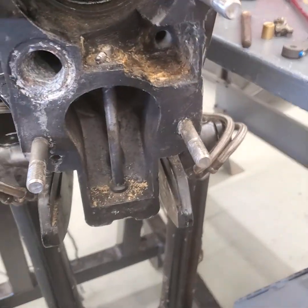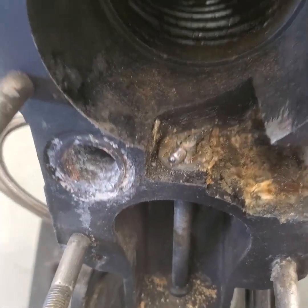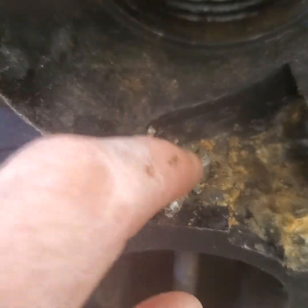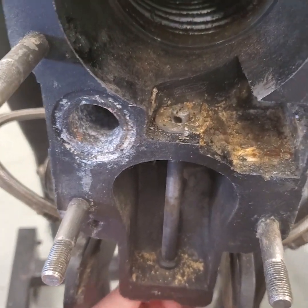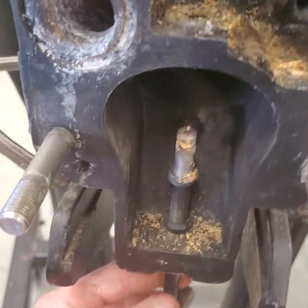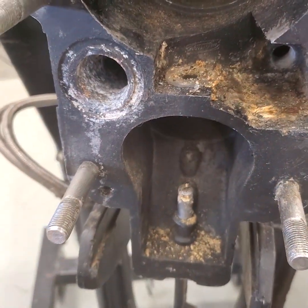So I've taken the lever off and taken a screwdriver and freed up this screw. I'll take that screw out — just push it out with your finger. It is sleeved, as you can see. You can just take that shaft right out now; I'm going to wiggle it and pull it straight down. And there's the old seal — the center of the seal actually came down with it. So we're going to drive it out; I'll get that set up and show you that next.